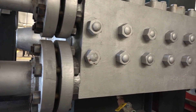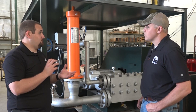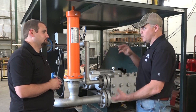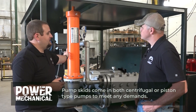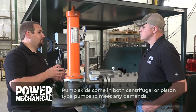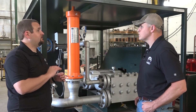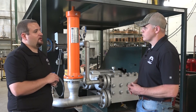This dampener helps absorb the difference in pressure to make the water flow going into the pump smoother — more laminar flow. It's a gas-filled cylinder that absorbs the shock of that inlet pressure. It's filled with a compressible gas, nitrogen in most cases, and that has to be dialed in at each site because conditions vary. You have differing water pressures coming into or being discharged from the system. By being able to dial in that pressure, you can really smooth out the flow of water coming into the pump.